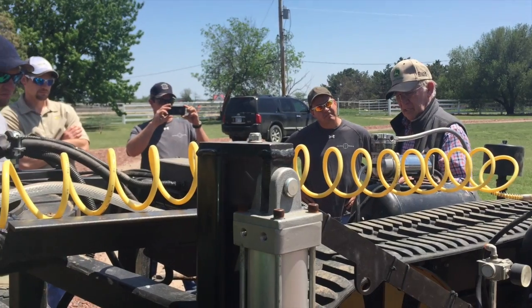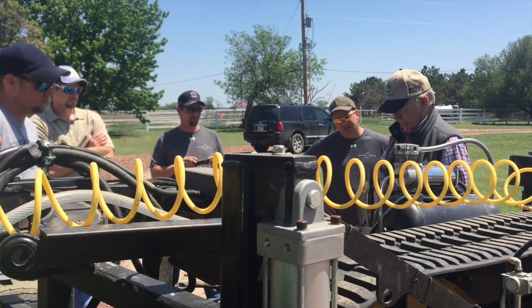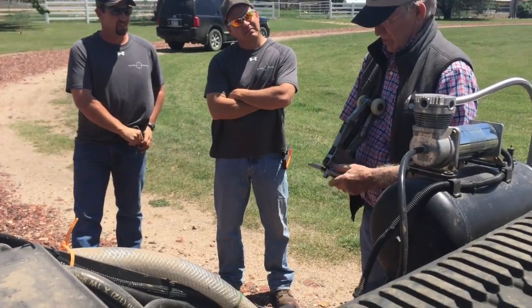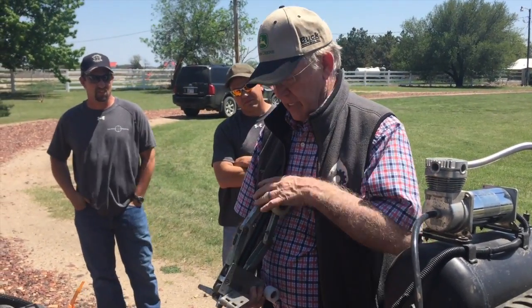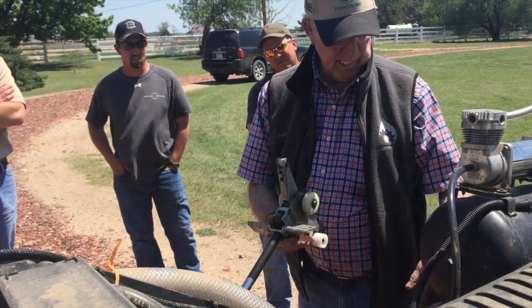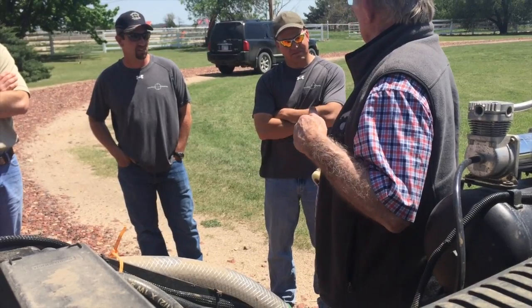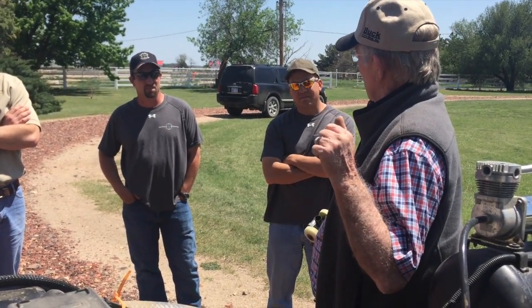What that tail told me is if I start out with a probe in the front, in this position right here, when nothing's sticking out, and as it rolls over, because it's not going to move once it hits the ground — so the time it's halfway over, it just pushed it in the ground six inches, and the second half of it rolling over, it pulls it back out of the ground. So it gives me time, while moving on the go, to take a perfect probe core.